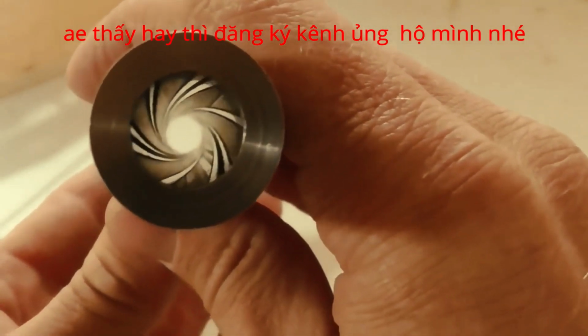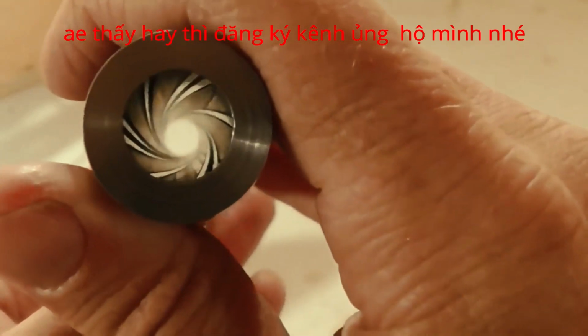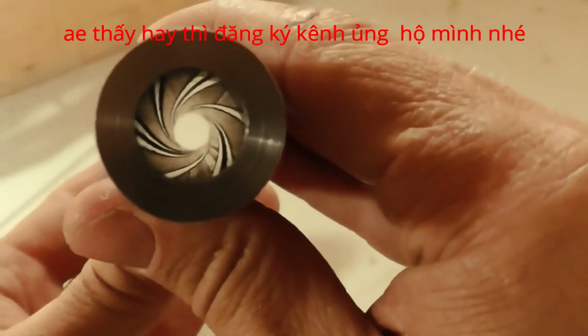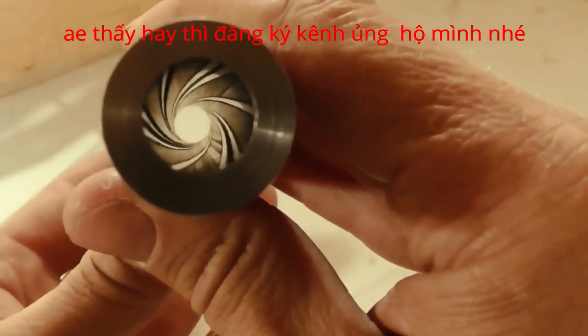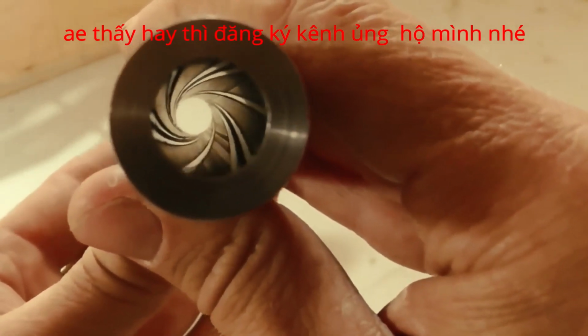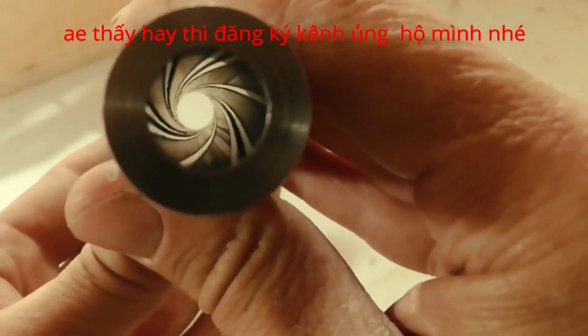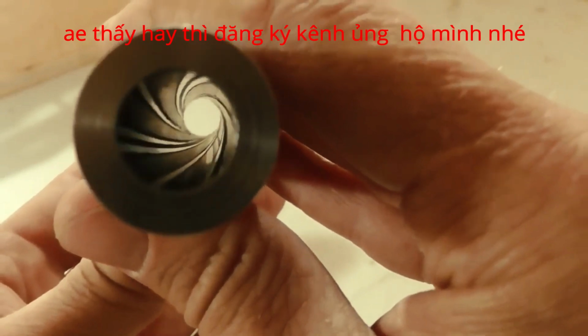And there is a nicely rifled barrel. I ran the button through 3 times for a total of 9 grooves. I ended up getting the spacing a little bit non-uniform, so 2 sets of grooves came out real close together. But it actually looks kind of artistic, and I expect it'll work just fine.